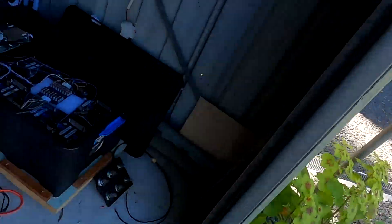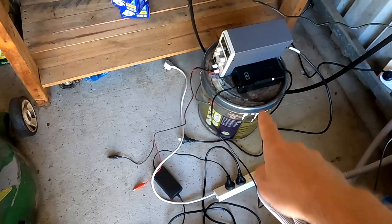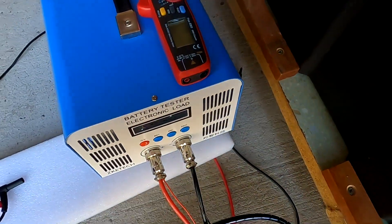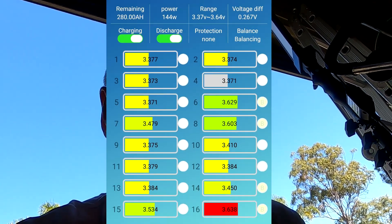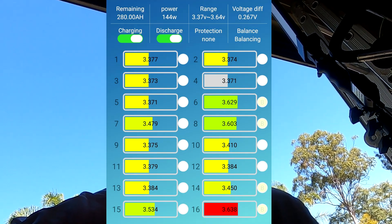I top-balanced the battery last night. I had the Blue Eddie sitting here with everything connected to my portable battery — the power supply there, the charger here, and also the 40-amp Chinese charger in use. As you can see from the screenshot, at 55.1 volts we had several cells going over 3.6 volts again while others like number four were still under 3.4 volts — a total mismatch.